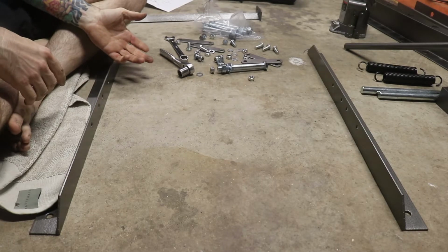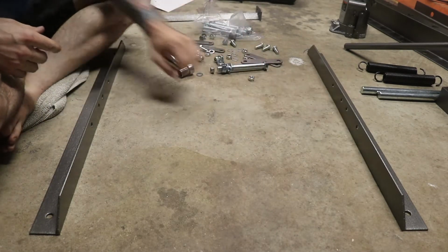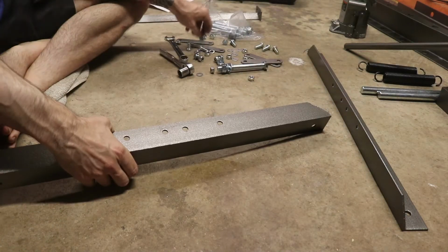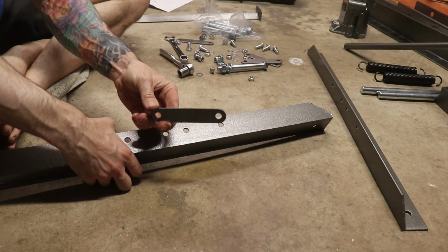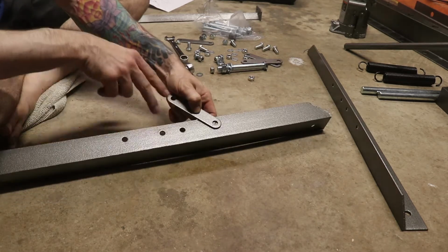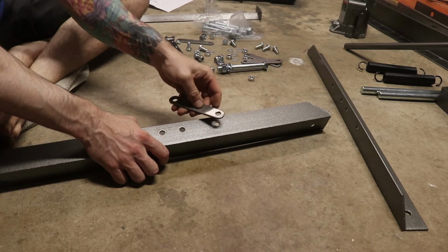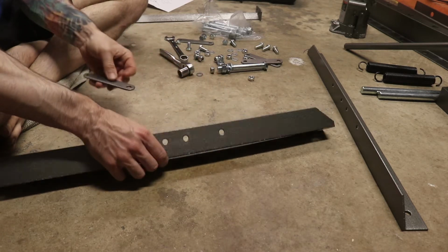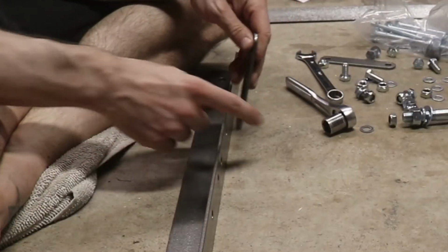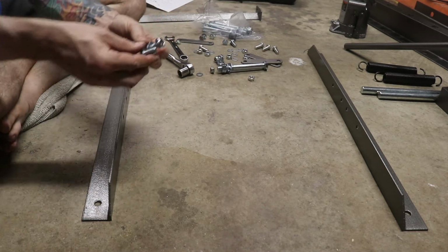All right, so to begin our assembly, I have the 2 angle iron pieces, this guy and this guy over here. First thing I'm gonna do, you'll note on these, there are 4 holes here. The ones on the ends, these little guys here, they go on here, and they're support braces for the uprights. The uprights get attached to here on the bottom, and they get attached in the middle. So I'm gonna put the bolt in for these guys first and attach these guys loosely. These go on the inside, so on this side, not on this side, like so, and they get the shorter bolts. So these guys, they're 20 millimeters.